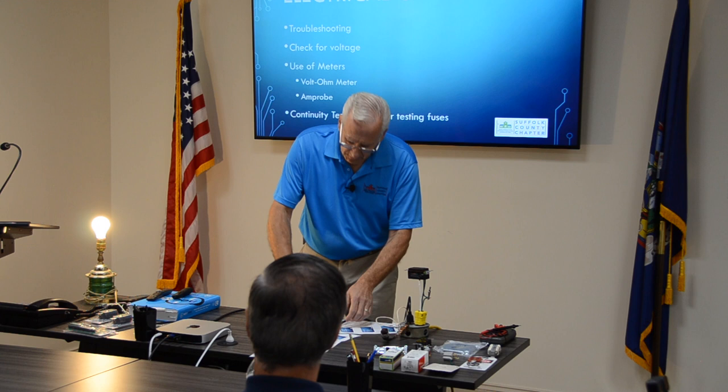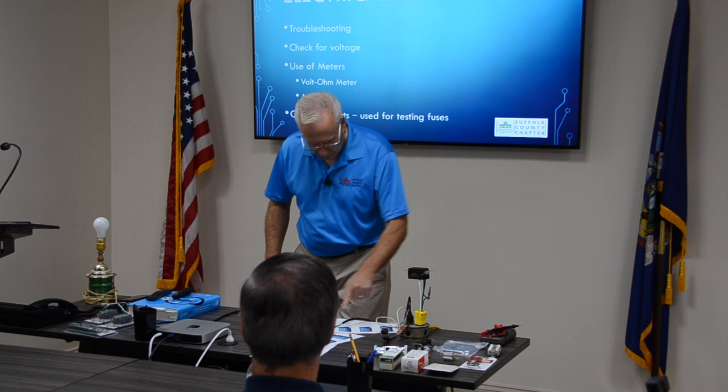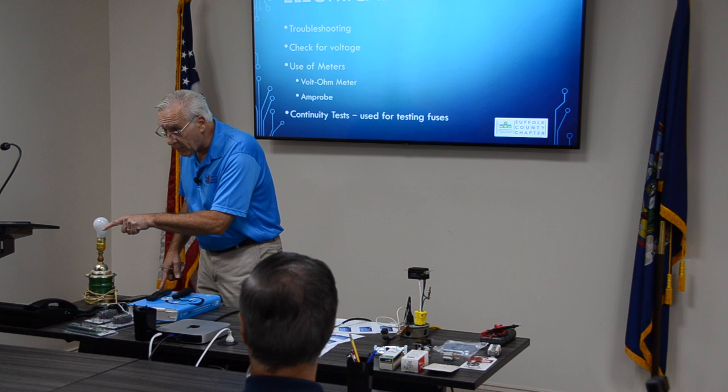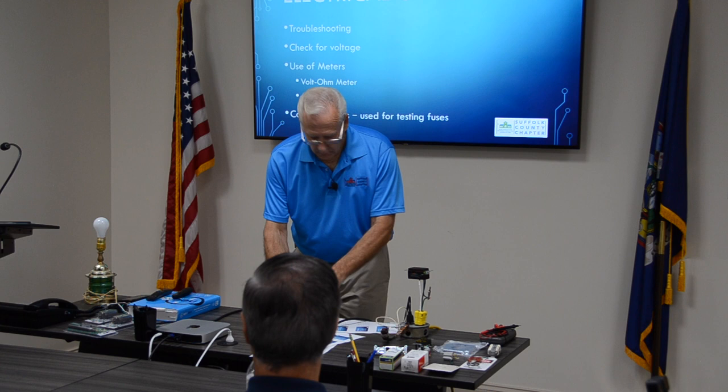Now, obviously, the light goes out. Power's still on. You get that part? Power's still on. Black. Yeah. It's going through this black wire. It's going all the way through this thing, through the filament of the bulb. Now it's coming back on the white wire, and it's ending up right there. You understand? If you touch that right now with your hand, what I'm saying is, anytime you see that light on, I'm getting electrocuted.